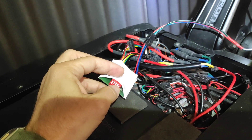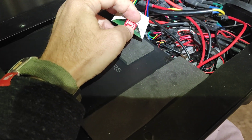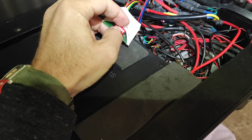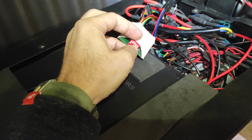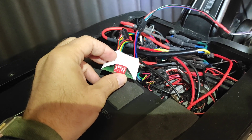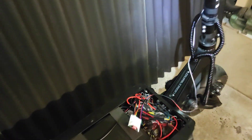It's not spinning. Now it started spinning when we pushed three, but if we pushed two, it's still not spinning. Let's push the third one — it started spinning on the third one, which means it's too high. The highest valid setting is pushing these two together. This is binary number three; binary number four — when we push this third one together — is too high. So the correct highest is binary three. Let's try the response now.